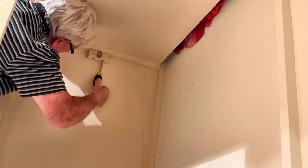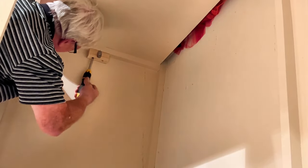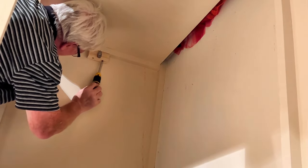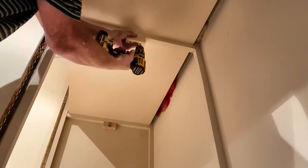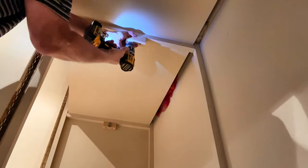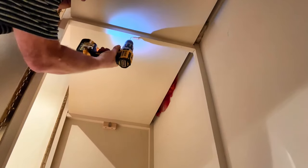If you're wondering why I went to the trouble of making up the timber support blocks rather than just screwing the rail support bracket directly to the side of the wardrobe, like you normally see on an IKEA flat pack or similar, it's because I didn't think the panel was substantial enough to take the weight. It's then just a case of wash and repeat to do the support blocks for the centre position and the other end.